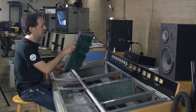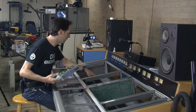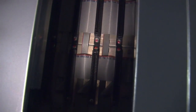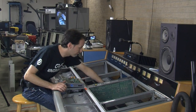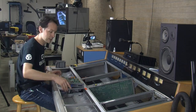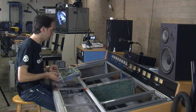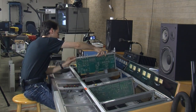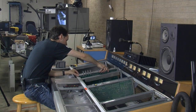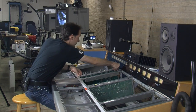This is one of the input cards — it's an MI64 card. On the bottom they use card edge connectors; there are three of them. These connect down into the frame where there are all kinds of sockets in rows — they look just like 8-bit ISA slots, actually. There are three sockets in some sections, four in others. Down on the lower part, where the faders go, there's a single slot connected together with ribbon cable. So this just slides right in — it's number 18. I'll take my sticker off, line it up, plug it in like that, make sure everything lines up just like it's supposed to, lined up on the back and with the metal, then seat it firmly in place.